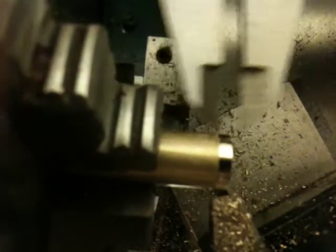That right there is going to be it, and this is the 4mm that the hole went in, so the hole should go past where that cone turns down — so that's good. Now I'm going to turn this down by turning and then moving in as I go, until I obliterate that hole at the end, and then I'll drill that out again.